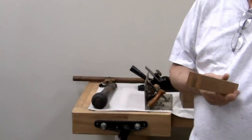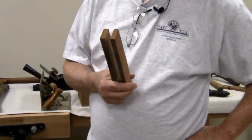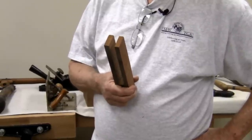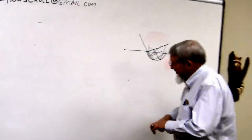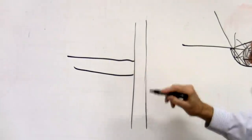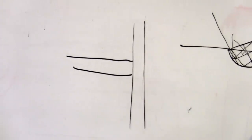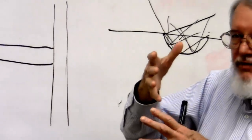Stanley called it, I think it was a number 100 siding gauge, where you struck a line on the siding cut. Yep. The number doesn't ring a bell. Yeah, I can sketch it better than I can describe it. If you were building a house and putting siding on it. Clapboard gauge. Okay. This is a corner board or a barge board, and your siding butts into this. Right. This straddles it, and if you strike this line, that's your end cut. Right. Stanley made a little gadget that did the same thing with about four or five fingers that you only moved like three quarters of an inch that left you a cut.